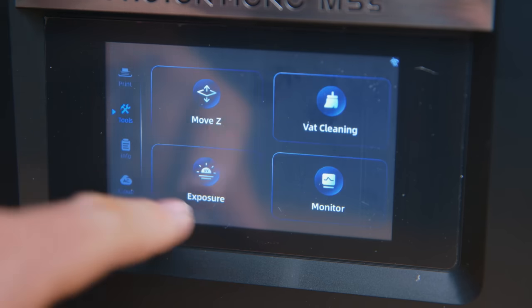The other callout feature comes from the M5S. Not only does it have automatic bed levelling, but the pressure sensors are also used to detect how much resin is in the vat before you print and warn you to top up — that's really useful. It can also sometimes detect if models have fully or partially fallen from the plate mid-print. When it detects this, it will pause the print, and if you manage to get Wi-Fi working, it'll send you a phone notification too. I have had occasional times where it's failed to detect a partial failure, but it's never given me a false positive.